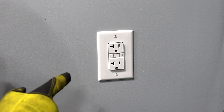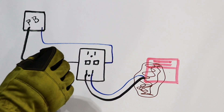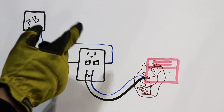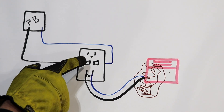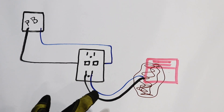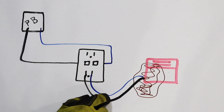As you start testing your GFCI outlets, you'll get a feel for how the test and reset cycle works. If your GFCI outlet is not resetting properly, it might be time to replace it. This outlet should trip within milliseconds — hundredths of a second — to prevent current from shocking anybody. If you hit the test button and it takes a little while to trip, that delay is essentially how long power could go somewhere unintended. Any type of delay — if it's not almost instant — means it's probably time to replace it. I read about an instance where it took two to five seconds for a GFCI to trip; that's potentially two to five seconds of someone getting shocked.